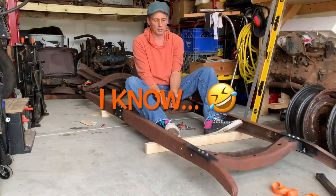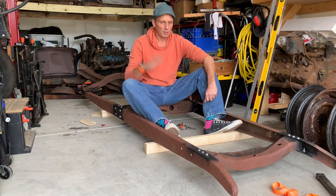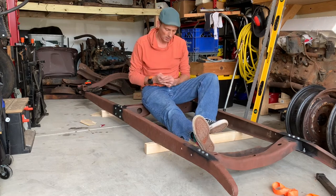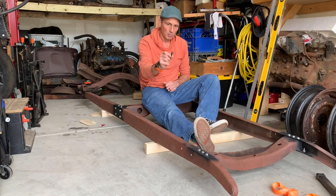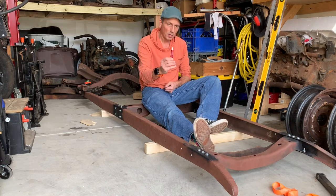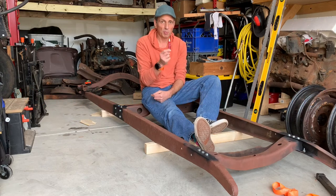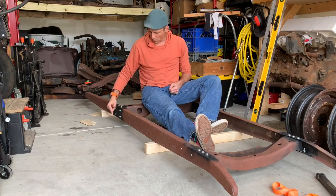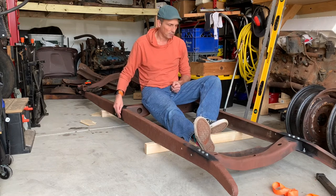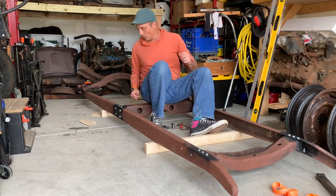All right, so I got my clean nuts here. No longer golden shiny, kind of gray and dingy, but clean. I like them this way. And my frame is all bolted together and tight and square. So the next step is to start taking these bolts out one at a time, drilling them for the permanent button head cap screw bolts, grade 8 hardware. Going to be using a red permanent must-remove-with-heat thread locker, not sponsored, hashtag not sponsored, sponsor me, on all the bolts with these grade 8 flange nuts. So I'll take one out, drill it, do the other side, measure, and repeat. You get the idea. Anyway, let's get to it.